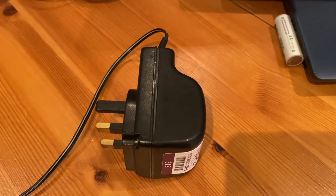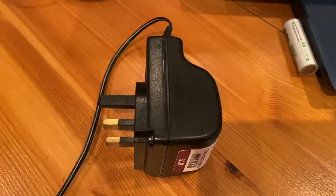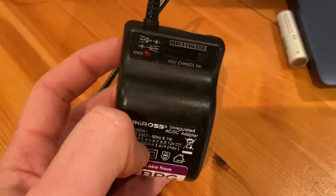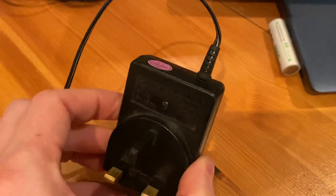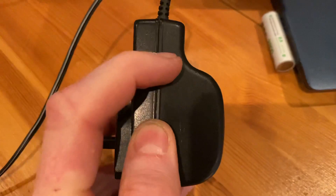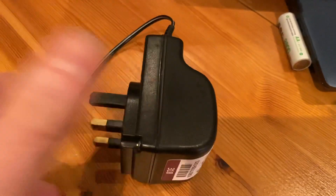They are a visual inspection only. You cannot do a Class 1 earth continuity test on them, and you cannot do a Class 2 insulation resistance test on them. On this particular one, because it's Class 2, you would do your visual inspection and then try to do an insulation resistance test — but because there are no exposed metal parts, the whole thing is encased in plastic. There's a tiny screw in there but you wouldn't be able to get to it once it's plugged into your machine, and it's likely in a plastic thread inside. So there's no way of any internal parts touching the metal component of that screw — you can't do a Class 2 check on it.